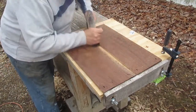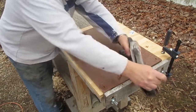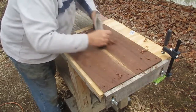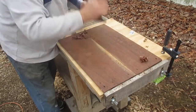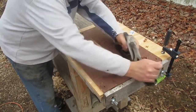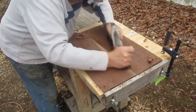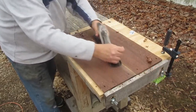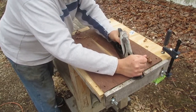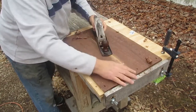Now that we have the top plate out of the clamps, the first thing I have to do is level the center, in case things didn't get flush when we glued these two pieces together — and they didn't. That's a common issue, and it's one of the reasons I left the blanks thicker. I'll start in the center and make sure it's smooth and even on both sides, with no ledge, just nice and smooth.